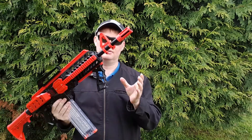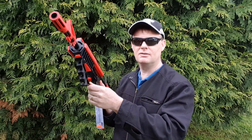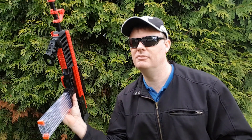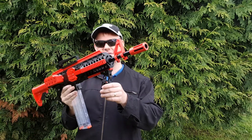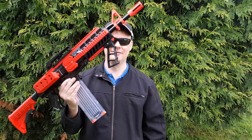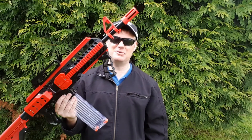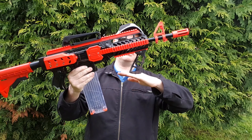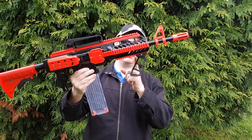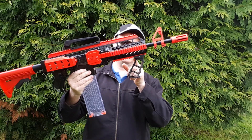I have the front grip with holes in the bottom. The first thing I would say: do not print this at 15% infill or even 30% infill. I printed this at 85% infill and I would suggest you print it at that or more, because it's obviously very flimsy-looking even though it looks cool. I printed it with the bed here, which meant I needed some supports just here - from here to here. Those are the only supports I needed to add as manual supports.